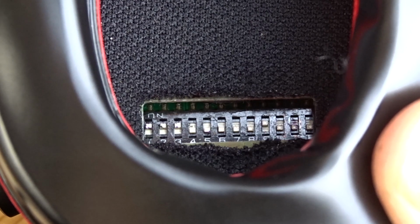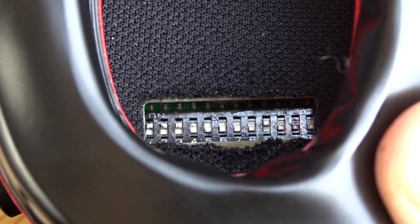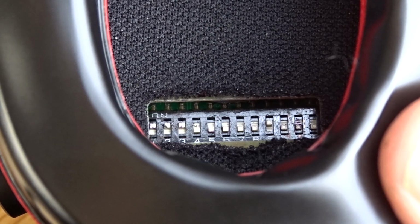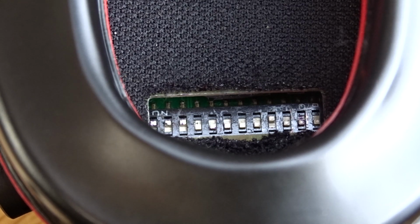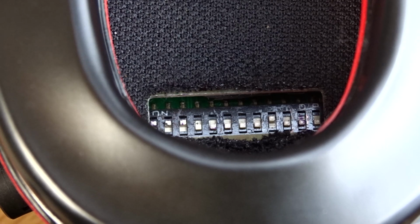7 is for a second radio mic, and I'm not using a second radio. 8 is for a PTT type, and I'm not using a type that requires that switch to be on. 9 and 10 is the mic setting for which way the microphone works. Is it the mic on the ring side of the plug, or the mic on the tip side of the plug? Clearly I've got switch 9 on and 10 off. And 11 is the mobile transmit level and 12 is the mobile receive level, and these can be adjusted on or off. So that's pretty much the switches as they go.